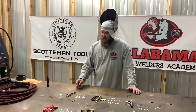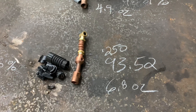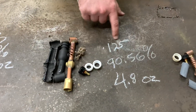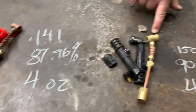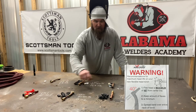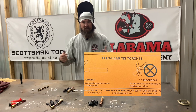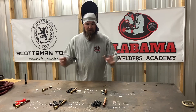We also used dial calipers to measure the wire size. The Weld Craft has a quarter-inch wire coiled up for the spring in the head. The Weld Tech was .180. The Profax, .125. China, .123. Heavy Hitters, .141. And the CK was .150. A lot of these come with instructions that tell you don't flex right at the head and neck — you want to spread out the flex over the length of the neck. You don't want to just pull the head back because you'll break the internal tubes. Some recommend 40 degrees of flex.